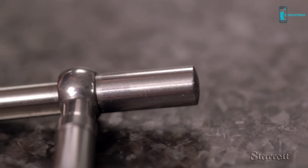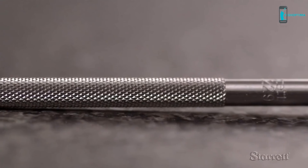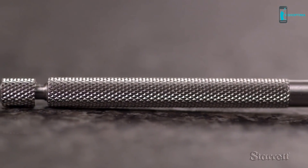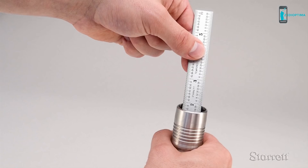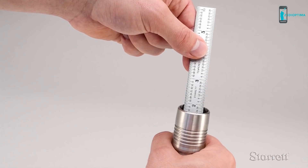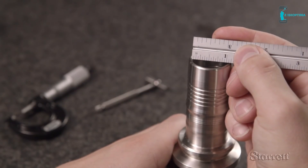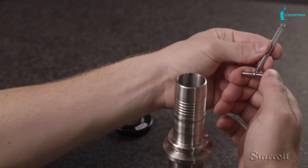The ends of both contacts are hardened and ground to a radius less than the low end of its range. Using the length of its handle, it can determine the diameter at a point well below the part surface. Let's try out the 229B to measure the diameter of a hole at a depth of about two inches. A quick measurement with a rule determines that the hole size is a little over an inch. Squeeze the gauge closed to a bit less than the hole size.